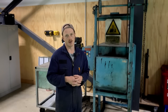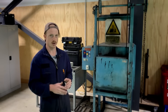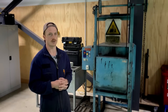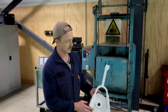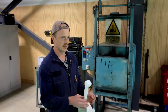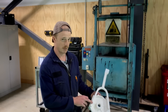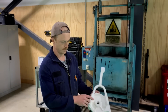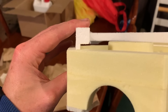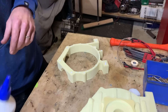I'm pretty average at videoing things at times because sometimes I just get the ball rolling and videos slow down the progress, but I like sharing things. Here's the part — so this is about a 22-odd millimeter sprue, and these are I think 16 millimeter, so they're all constant surface area into these little feeders. Here's the pattern all machined out of two pieces of extruded polystyrene glued together. This is a whole different engine to the V4.